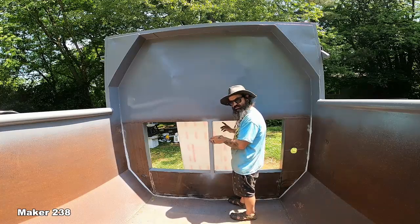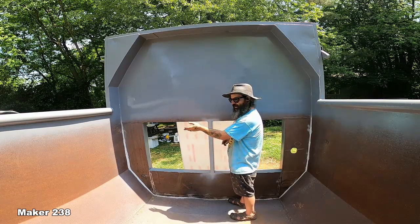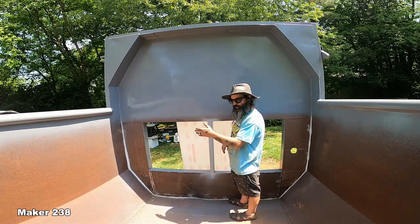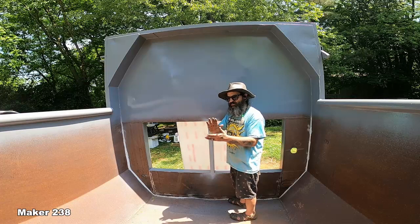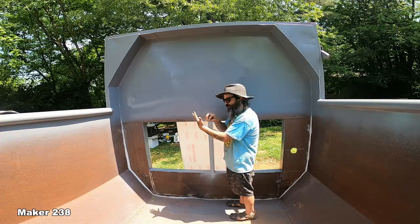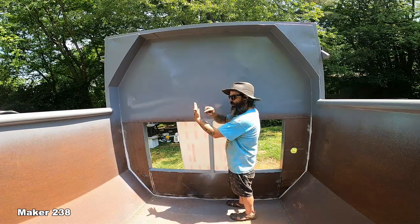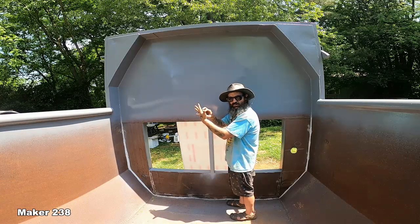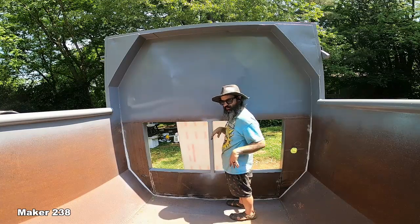And what I'll do is I'll scratch the back of this Lexan glass where I'm going to put the adhesive. I talked about that in another episode, that any kind of adhesive, glue, epoxy, even paint, think about paint, kind of the same thing. Whatever surface you're putting that on, you don't want it slick and smooth, because then it has nothing to grab a hold of. So if I sand the edge of this Lexan glass here before I put the silicone here, now it's got something for that silicone to adhere onto that Lexan. Almost gives it like a little bitty sandpaper effect, kind of like a Velcro.